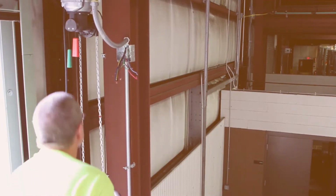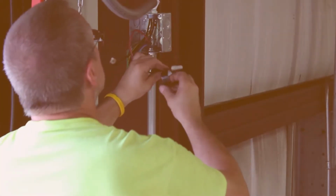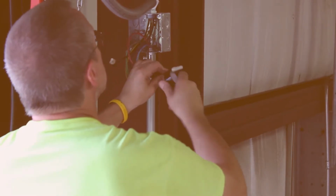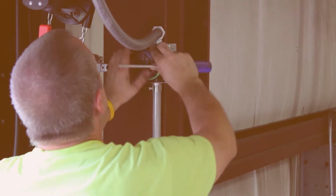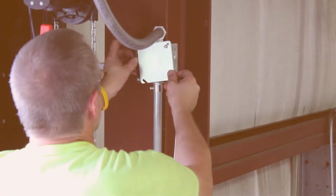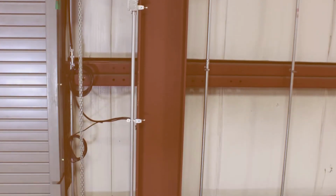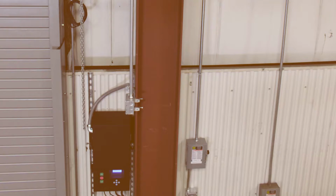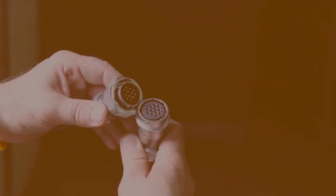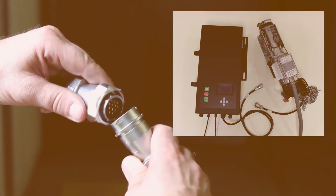Now we'll power the motor by connecting to the control panel. Match the wire colors, black, brown, blue, yellow, green, to the top junction box and connect with wire nuts or crimp style splices. Use rigid conduit between the junction boxes and then connect the Apex Smart Controller to the bottom junction box. Once again, refer to the diagram in the operation manual if necessary. Then, plug the brake power cable from the motor to the encoder cable from the panel.